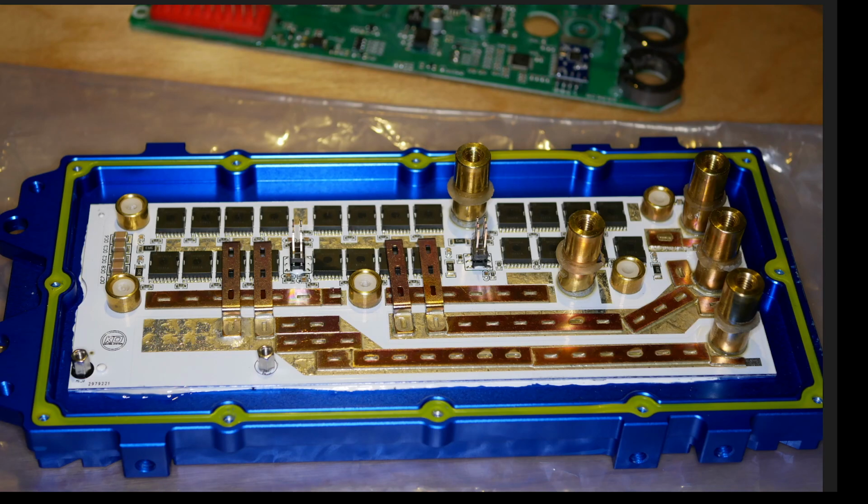This is obviously the power stage from my Pro controller. And you see the same shoddy work here. Crooked bridges, all these little scraps of copper laid down from some spool, same old BS as before. These holes, they let heat out. Whatever. What a load of crap. Giant gaps in your battery minus bus, big gap there, gap, gap, gap. No battery plus reinforcing.